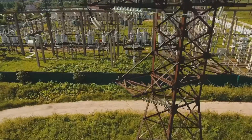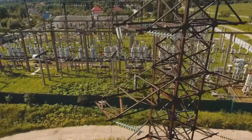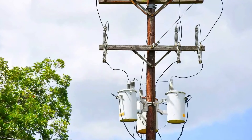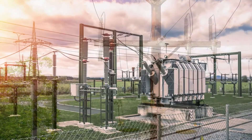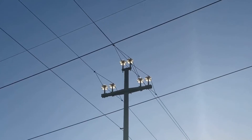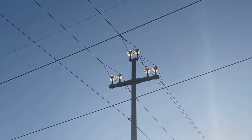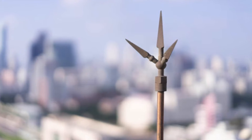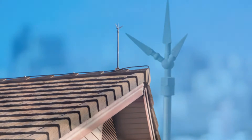To prevent such damage, we use devices like surge arresters, lightning arresters, and lightning rods. Surge arresters are placed inside the power line, absorbing surges and protecting the circuit. Lightning arresters perform a similar function but from outside the conductor, installed in the transmission tower to absorb electrical surges.